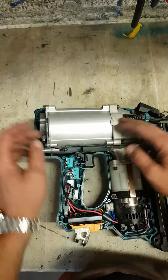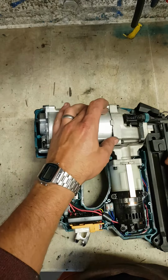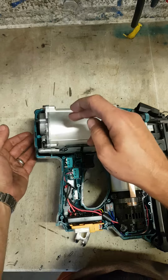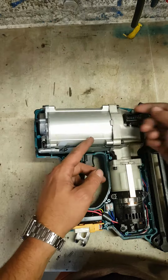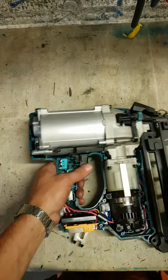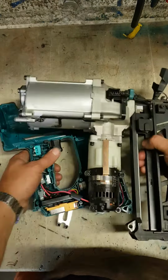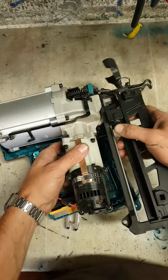So that exhaust gas then goes back into the main chamber, which pulls your pin back a bit. So then inside your pin chamber should be less pressure. Then your main chamber should push the pin back up. Obviously that's not happening. Probably from a bad O-ring or seal somewhere. So we'll open her up and have a wee look-see.